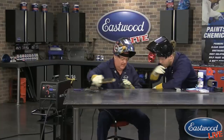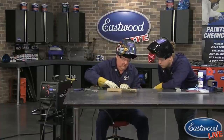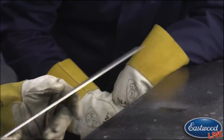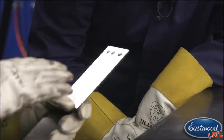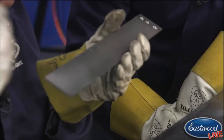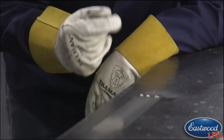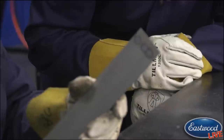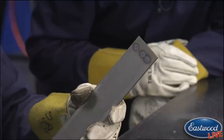See how I held the torch over the top after each weld? Here's the penetration from the back side — looks nice. If the weld was too hot or too cold, you'd see a very shallow or very deep impression. The chart pretty much set us up nicely. You definitely want to see that discoloration on the back side — that's how you know you have good penetration. On sheet metal, you'll see a little bump.